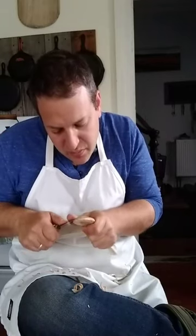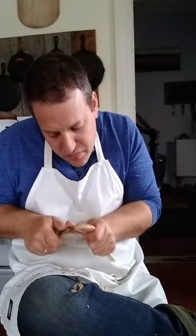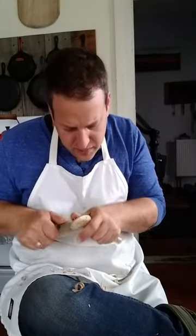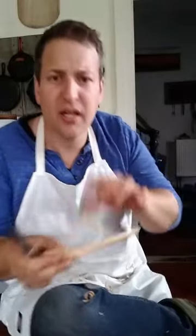So now I'm blending the back of the bowl, but just a little bit. I always do the final stuff on the back of the bowl at the very end once I've done the inside of the bowl, particularly on eating spoons. And leaving this a little on the thick side on the bottom here just gives me some insurance.